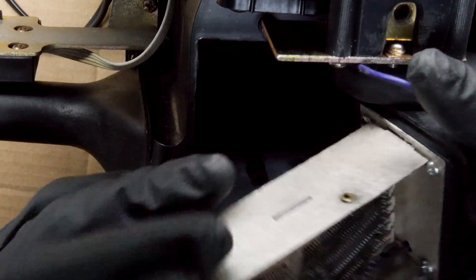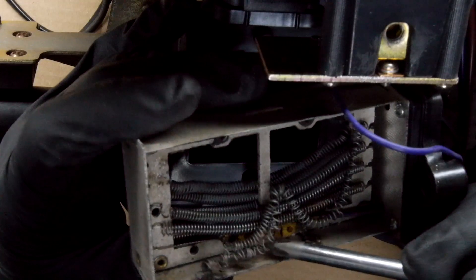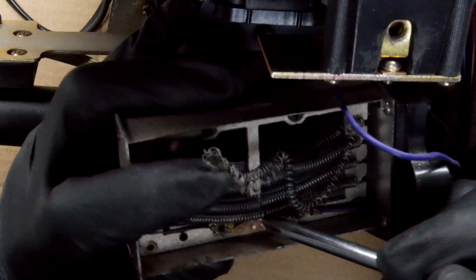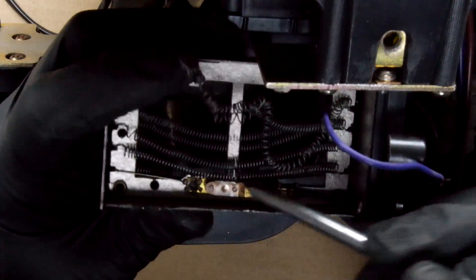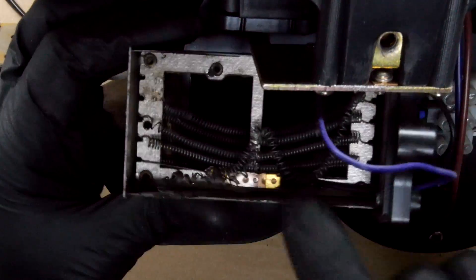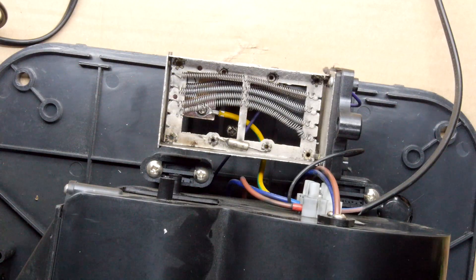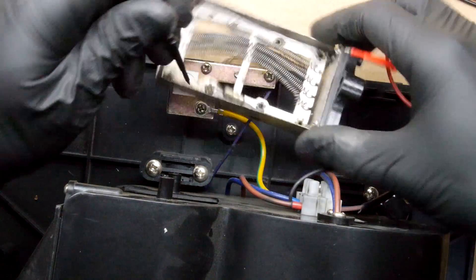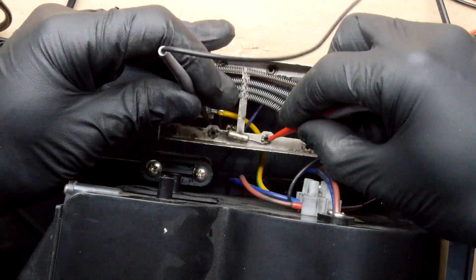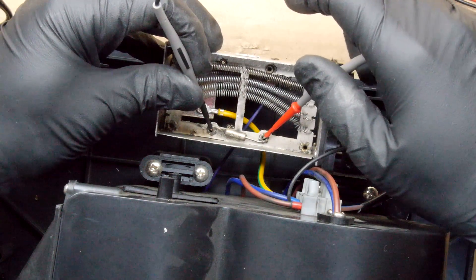It is possible to replace this sort of thing. There is a thermal switch in here — remember I do have this unplugged. But this has all bonded itself, that wire has actually bonded itself right in there. And we also have this thermal fuse — let's see if the thermal fuse is still active. Ha! So there is still power going through that fuse.